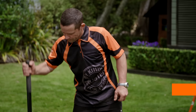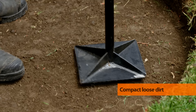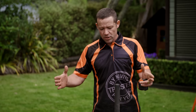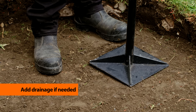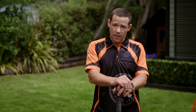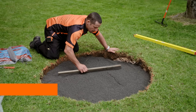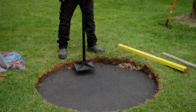Check your depth, and then compact the loose dirt using a tamper. If your backyard is prone to flooding, or if you've got a high water table, you might want to dig yourself out a hole approximately 300 by 300 and about 200 millimeters deep and fill that full of scoria — when it rains, the water is going to go down your little scoria plug hole. Then add the first layer of base course, about 20 mils deep, roughly level it out, and give it a light spray so the top is damp. Then once again, tamp down the whole area.